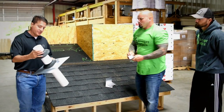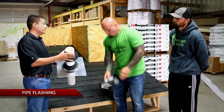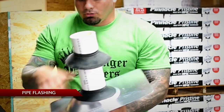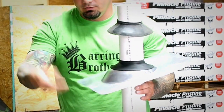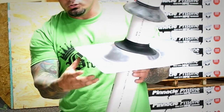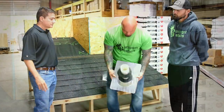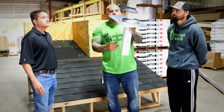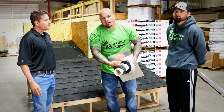We have an example here of pipe flashing. What are the common mistakes you see? More or less people shingling all the way around them — it traps the water in. The shingle seals, and then eventually it seals here. If the hole is cut too big, the water ends up coming in. The number one thing we have leaks on is plumbers: we put these on in new construction, plumbers stick their pipes up, pull them back down, and it rubs the pipe boot inside out. This always leaks.